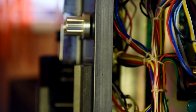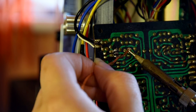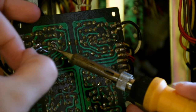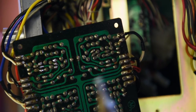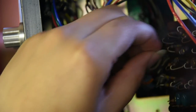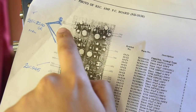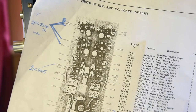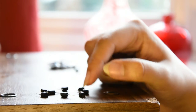What I must remember to do is make sure to do the isopropyl alcohol brushing to get the flux off — the excess flux — just in case. I don't think it's a good idea keeping the flux on the board anyway. So I have taken out and replaced transistors one to four on both sides. I just need to do five on both sides and transistors six, seven, and eight — those are only on one side. These are the ones that have been taken out and replaced.